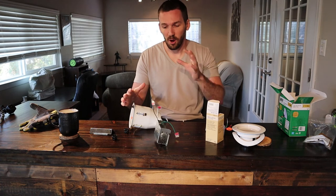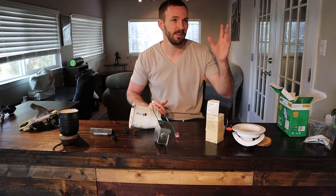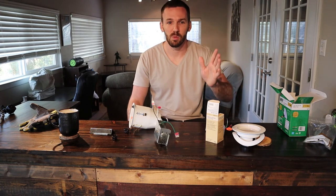Lastly you'll need the actual Romex wire or whatever branded wire you plan on using. I'm not an electrician but I know some of the basics. I got 12.2 gauge wire for my setup because I had 20-amp switches on my breaker. If you have a 15-amp switch on your breaker then you may want to run a 14.2 gauge wire — you'll have to discuss that with your electrician. By the way, I got this all quoted by my electrician — I already had the holes punched in and all the equipment purchased except the wire itself, and the electrician quoted me $1,900. There's no way. I installed all of this for about $200 total for two rooms, and it made the biggest transformation I have ever done in this house — bigger than new siding, new cabinets, all kinds of things.